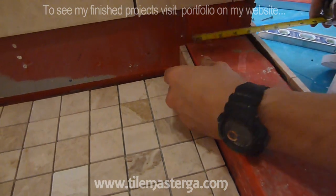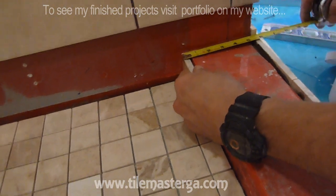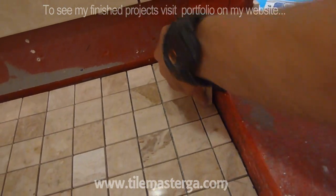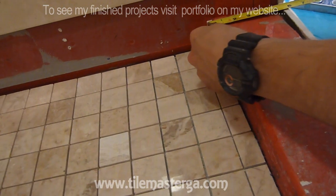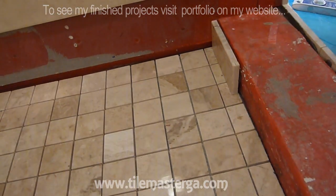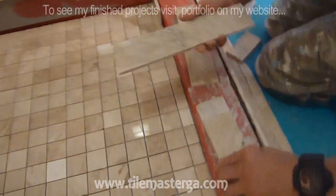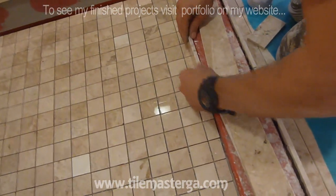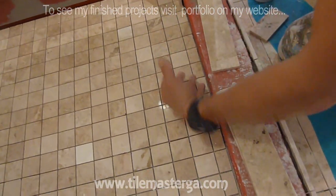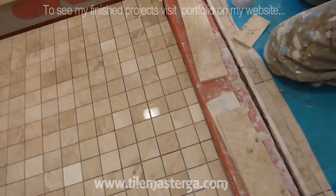Looks like we should be able to have the curb at 5 5/8 plus, which gives us 1/16 of an inch. And this is our curb. So same situation. The first thing will be to put all the pieces. I have this numbered. The floor is sloping right to the center, to the drain, so those pieces are cut to the floor accordingly. Already have this measured before.